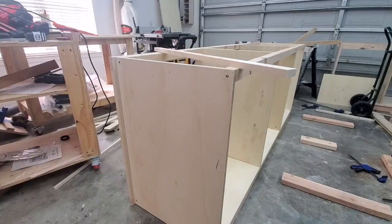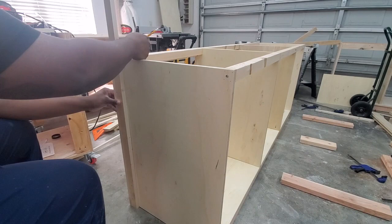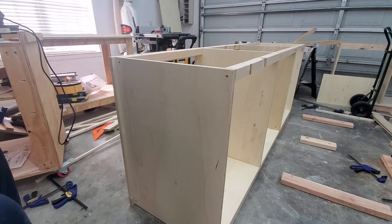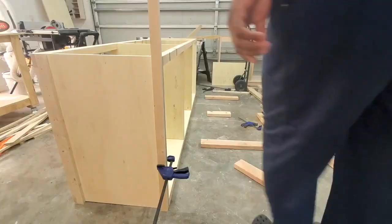Here's where that wraparound design comes in handy. I use some 1x4s cut down to size and put an X on the side, then use trim to cover up those screw holes. To eliminate any measuring mistakes, I grab my trim and a pencil, mark a line even with the top of the TV stand, take it to my miter saw and inch up on that cut until it's flush with the top. I follow this same method for all the trim that goes on the side.